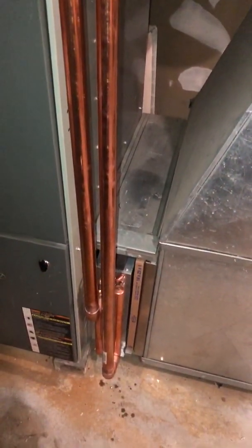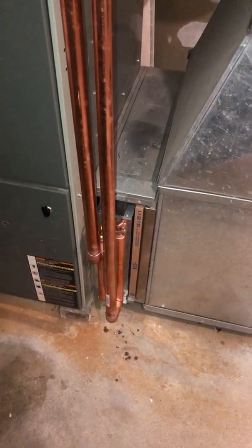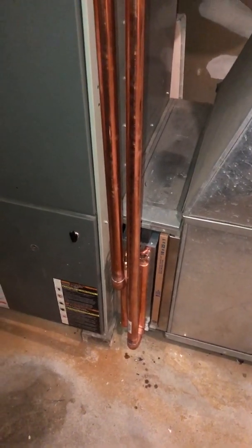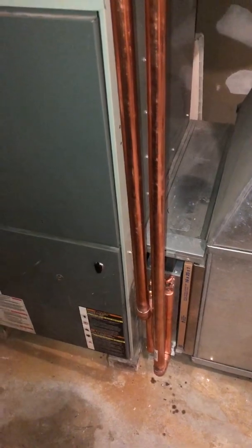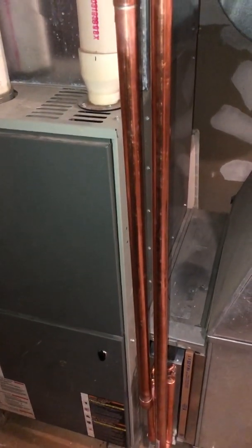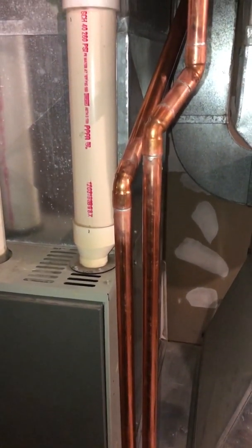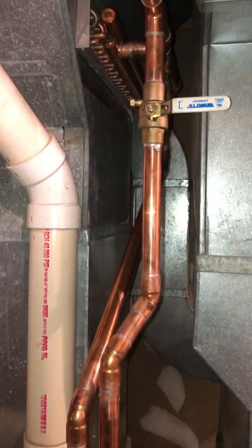And it seems to be working out so well, though it is a bit risky. If you screw up your method of doing that foam in trench and get water intrusion, you're going to be digging it up and doing it over. So as far as in-ground lines, I would highly recommend spending the money, getting the Thermopex lines or the Rehau piping. They're very similar to each other.